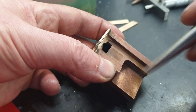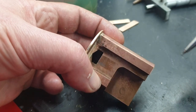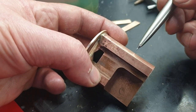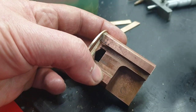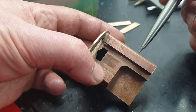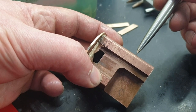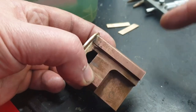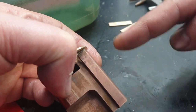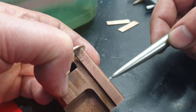Now then, just going by measurements off the drawing and so on is a recipe for disaster, because you know the boiler's been made. There are various differences to the drawing on the boiler. Even if it was spot on, the chances of finding the right pipe position are slim, considering the pipe is clamped a good 4 or 5 inches downstream of this, and of course within the boiler itself, this pipe's going to be wobbling about to some extent.